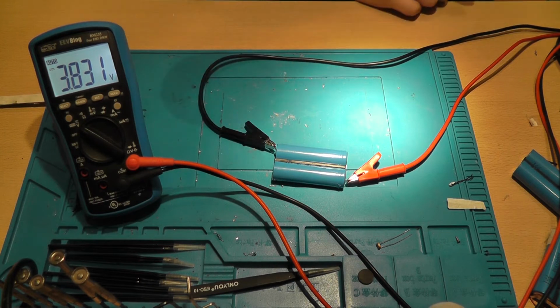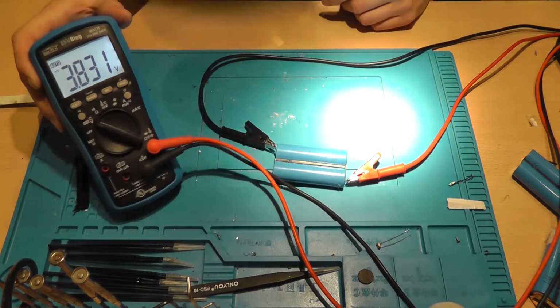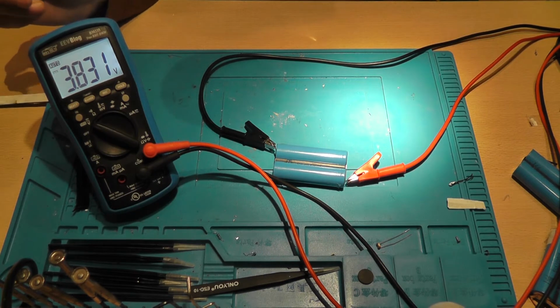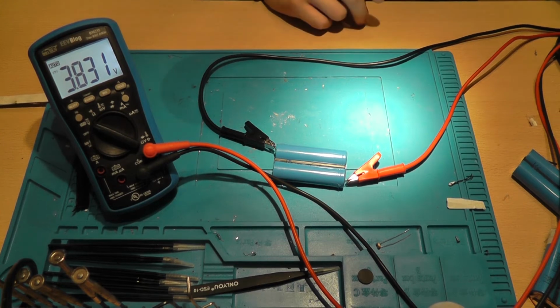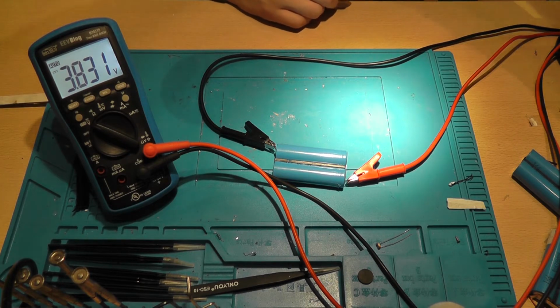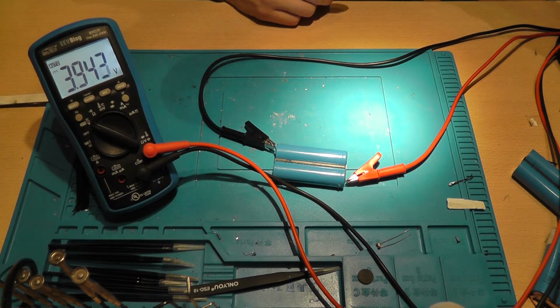Now I first need to enable a channel. The channel is on, but it's not enabled. It's active, so you can set the voltage, and the voltage needs to be set at 4.2 volts. No more, but certainly no less, because that's the specification that the datasheet shows. I already know this specification. So now turn on the channel